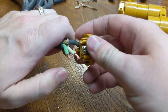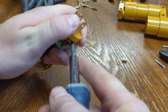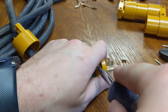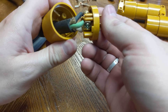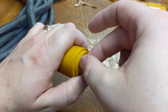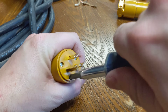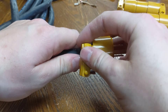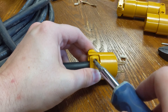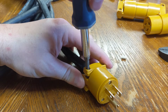Here I'm using my wire stripper — notice I'm only stripping off a very little bit, that's all you really need. If you've never done this before: the black wire is the hot wire and goes to the brass-colored screw. The white wire, at least in the US, is your neutral and goes on the silver-colored screw. The green wire — sometimes it might just be a bare wire — goes to your ground and will have a green tinge to it. I've seen a lot of DIY extension cords with wires going anywhere, and so long as they all go to the same spot and are parallel throughout the cord that's fine, but I really try to keep to the standards.